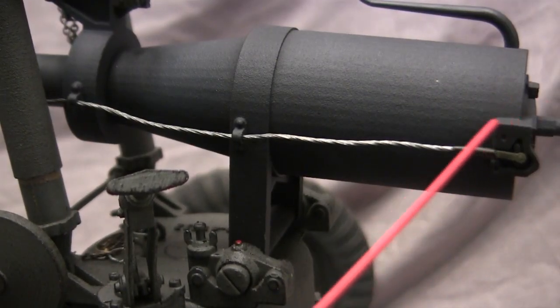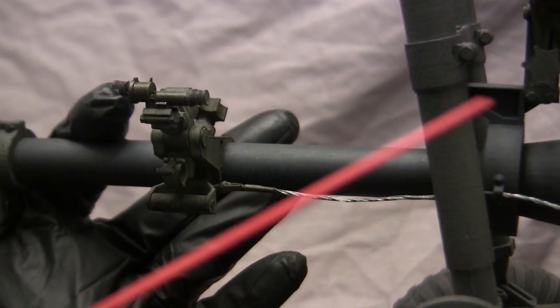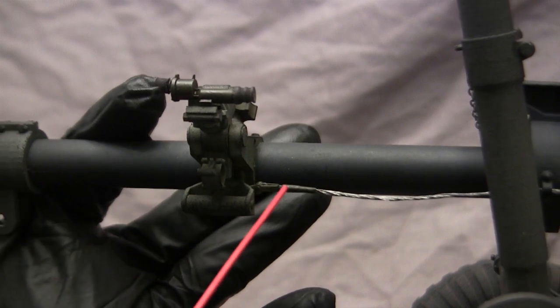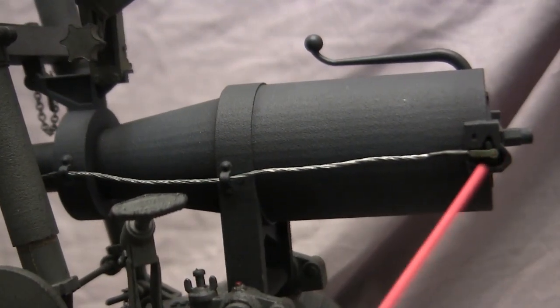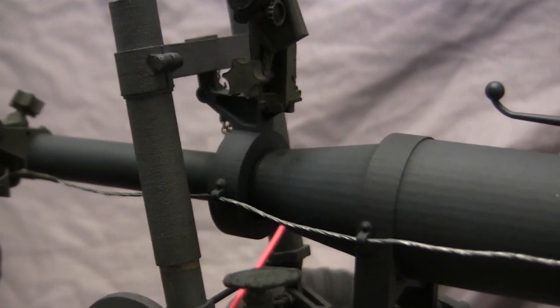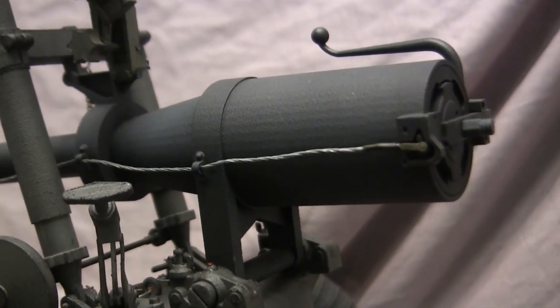Now, from the breech mechanism, this brings us to one of the more unique and one of my personal favorite attributes found on the M27 system, and that's the exposed firing cable linkage system. Now, like I said before, the gunner station is towards the side of the M27, and in order to fire it, that was utilizing this little cluster that we have here. There is a little handle, and this handle is connected with a clevis and a cable to the rear firing mechanism. Now, to fire the gun, the gunner would simply grab onto this handle and give it a twist, and this twist would pull on this linkage, on this little yoke that we have back here, and that would actuate the sear for the firing pin.